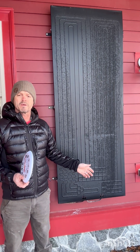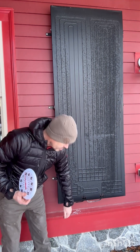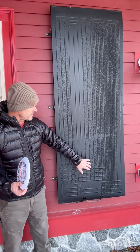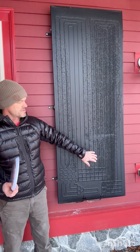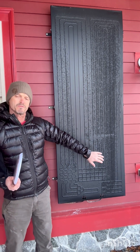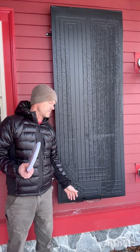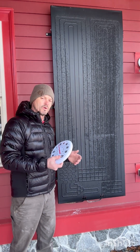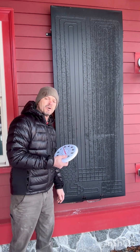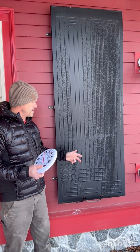This panel works three ways. The first way is by convection, which means the inlet refrigerant right now is very cold — probably negative 25 degrees Fahrenheit. The refrigerant goes through this panel and by convection it picks up heat. Even though it's 20 degrees out, from the perspective of negative 25 degree Fahrenheit refrigerant, that's actually quite warm. I'm standing next to it — you probably can't hear it in the video, but this is sizzling. That sizzling noise is the liquid refrigerant going into the panel and flashing off into vapor — it's boiling, essentially.